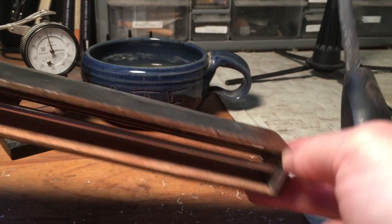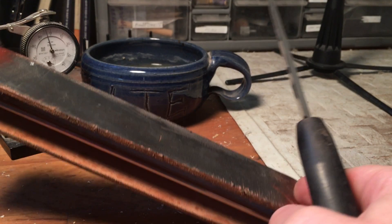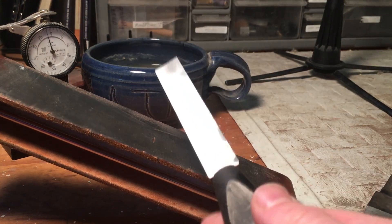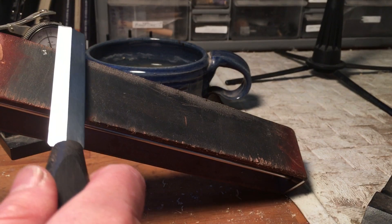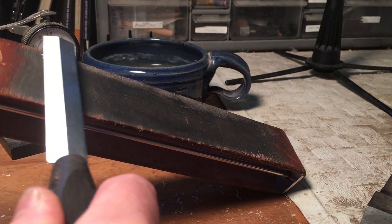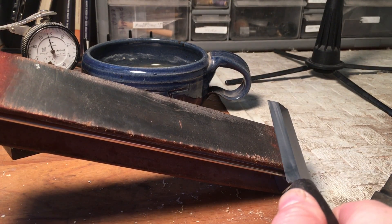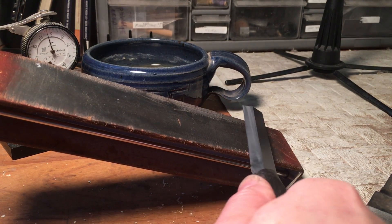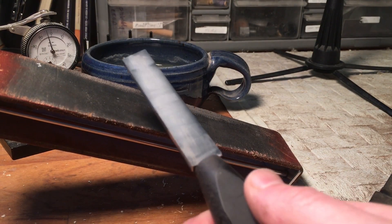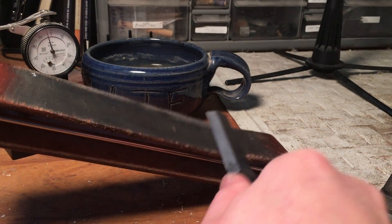Normally I rest the bottom part on my leg, holding it up with my left hand, but today I'm going to rest it on the table so you can see it. We're going to start with the flat side, place it flat on the strop, and go down. Now unlike the stone, we can't go up or it would dig into the leather — so just like we did with the stone starting with the flat side, in this case we're going to go down.